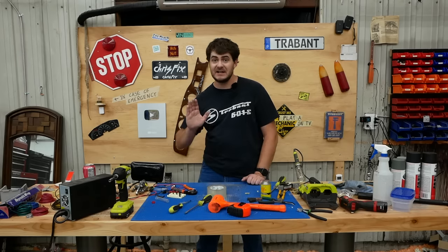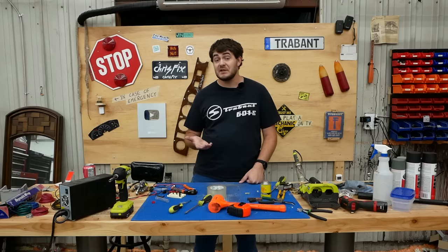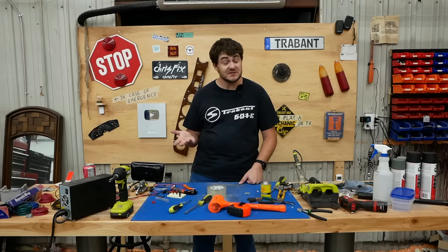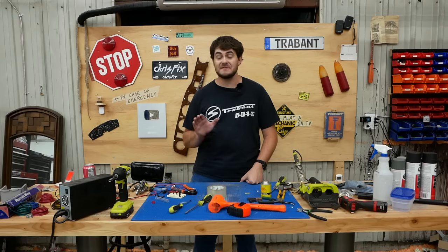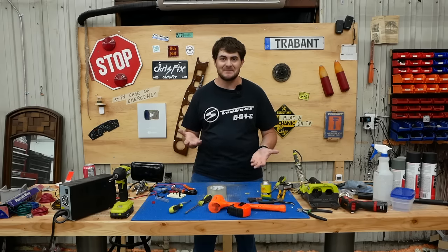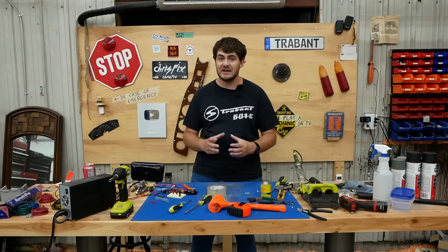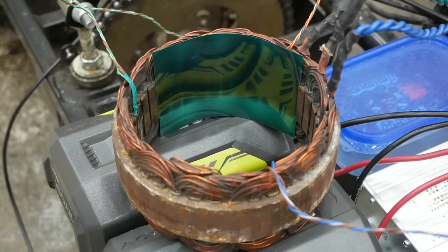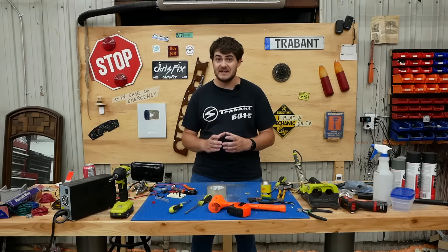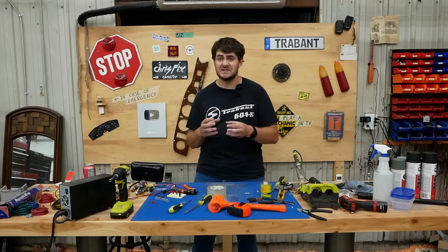This problem is only on startup — if I give the go-kart a nudge, it takes off with no trouble whatsoever. My guess is that because my alternator-turned-motor is sensorless, the speed controller is just chucking a three-phase signal at the stator and hoping the rotor stays in sync. Because of the resistance torque on startup, the rotor immediately falls out of sync. Interestingly, I've read that in the absence of Hall sensors, the motor controller will somehow use one of the stator windings to sense the rotor position — which seems to hold some truth, because with no rotor installed the motor controller sent a couple of steps and then stopped.